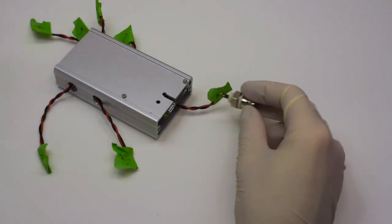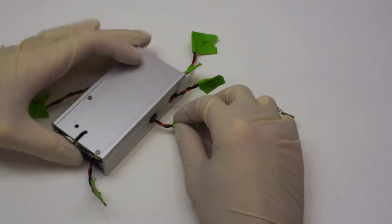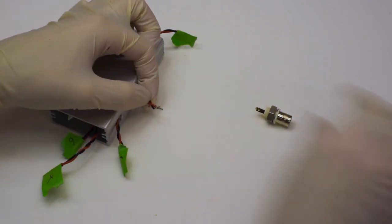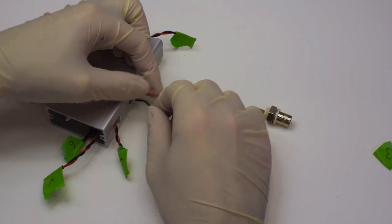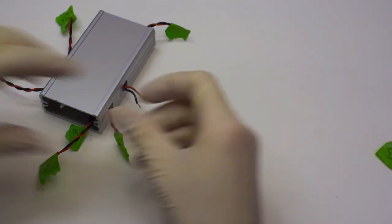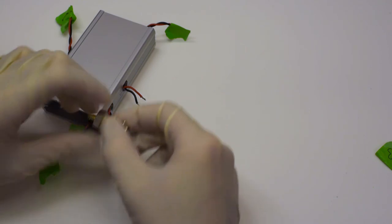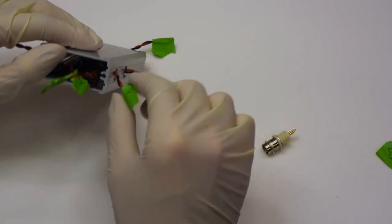And this is going to be a bit tricky simply because first off, the order matters, so you want to start with the innermost connectors because otherwise you won't be able to reach them with the BNC connector insertion tool. But as soon as you figure that out, you're going to want to shove the cables back in and thread them through the nut of the BNC connector. Ideally, this would have been done before the entire insertion, so while we were shoving everything inside, but sadly, we hadn't figured this out that early.